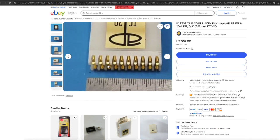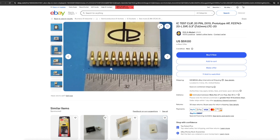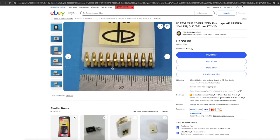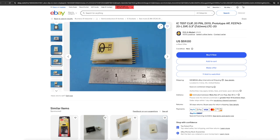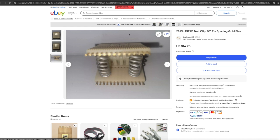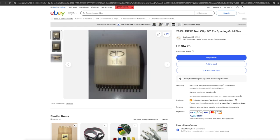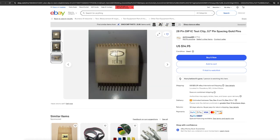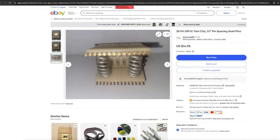These clips have visible pin contacts which have to be appropriately springy to maintain good contact to the IC pins. Plastic trapezoidal contact dividers make it easy to clip on the IC, as it's easy to insert the clip between the IC pins and it's self-centering. All clips have a metal spring which provides tension. Shorter clips have one spring while longer ones have two for better contact along the entire length. Some of them have nail-like pin heads added to avoid slipping on connected probes.